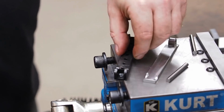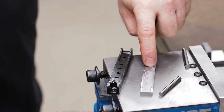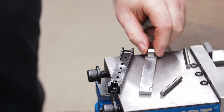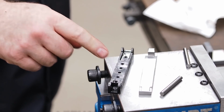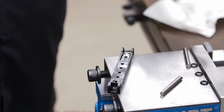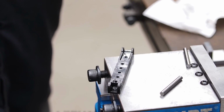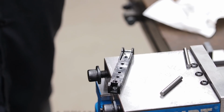The part would be a little bit warm to touch right now with the paper towel. It's not so bad, so we'll just set that right there. But you can see there's not near as much mass on this part, and so it will heat treat a little bit nicer. This, for the little torches we have, is just about the limit. And again, the key is trying to get that temperature nice and uniform.